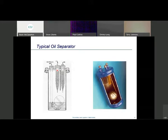Both on the inlet and outlet, as refrigerant moves slow, there's a little toilet ball float on the bottom. When the level rises enough, it allows flow through - this is all discharge gas inside. If we didn't have this ability to shut off that pipe going back to the oil reservoirs, we'd be feeding discharge gas directly back to the compressors. This proves there's oil in the bottom of the separator and allows it to go back to the reservoir to refill the compressors.